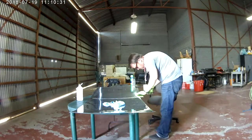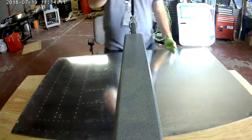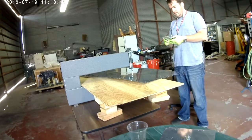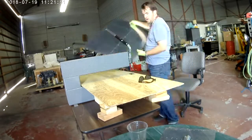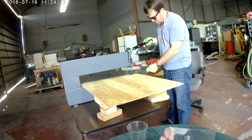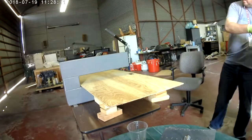Here I'm adding a little bit of a break. Something I may not have gone into before — every once in a while the instructions tell you to add a little bit of a break to one of the edges of the skins. That includes basically bending the last, I don't know, a little bit less than half an inch of the metal, just so that it lays down better. All these skins are going to go on top of the ribs and attach to the spars, but you don't want them to curl up at the end — you want them to sit flush. So you put like a little 7-degree break to the last half inch of the skin. That's what you saw me doing with some 3-inch seaming pliers that are made for bending sheet metal like gutters, but it works perfectly well with aircraft aluminum.